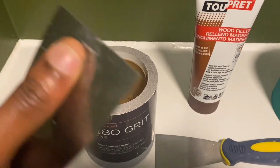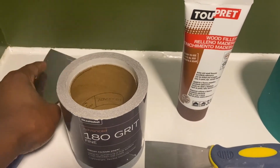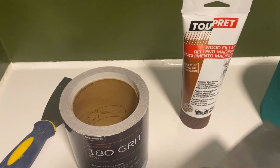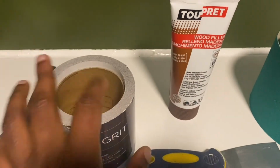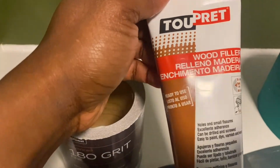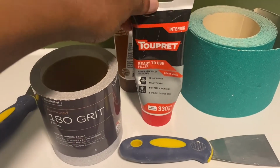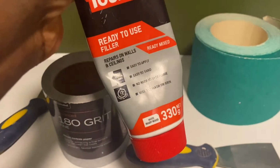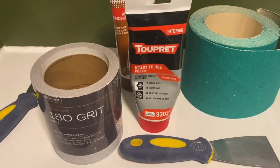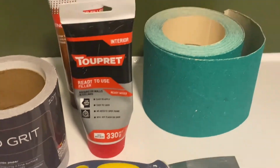Make sure that you're not mixing up the wood filler for wall applications and the wall filler for wood applications. In this case, I wouldn't be needing any of them fillers. Okay, so it's just a question of removing the flaky paint. The wall's been primed before, so I don't need to prime it, and just smoothing out the edges. Sandpapering down the flaky bits gives it more adhesion. Sandpapering over the trim edges and the flaky paint that's been removed would provide adhesion for the subsequent paint that will be applied onto the roof.